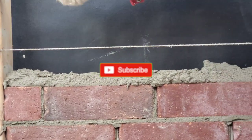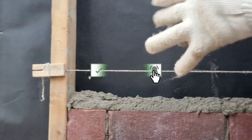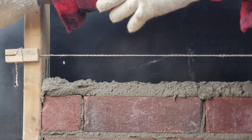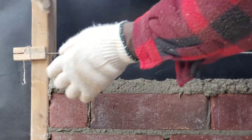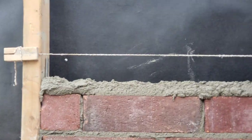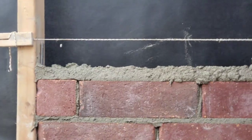Cavity. So here, being as we're gonna put stone here, we wanna put a brick tie, we wanna bend it like so, place it right here. Later on when we're gonna install our stone, we're gonna flip it over and then this is gonna lay flat on top of our stone. Put that every four courses as we go up. Okay, let's lay some brick.